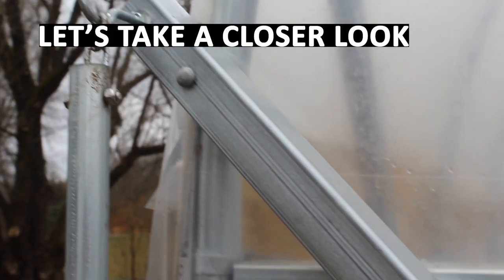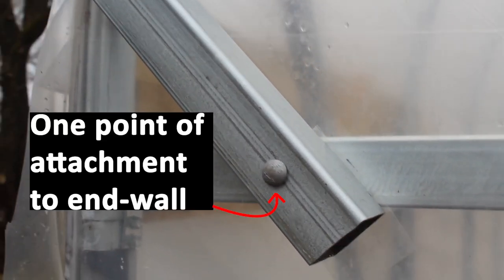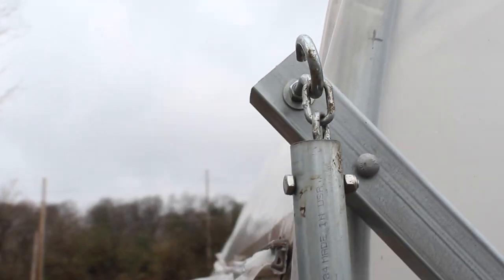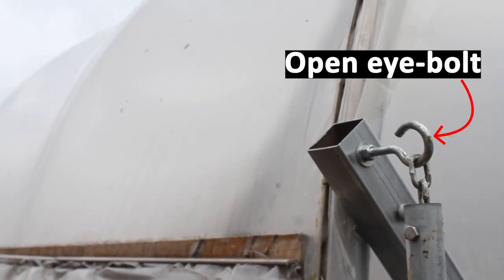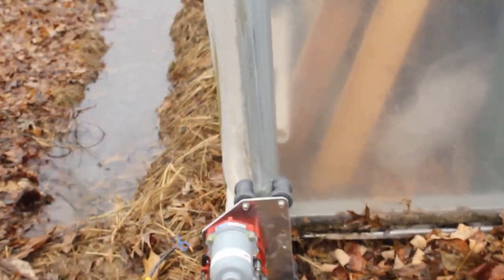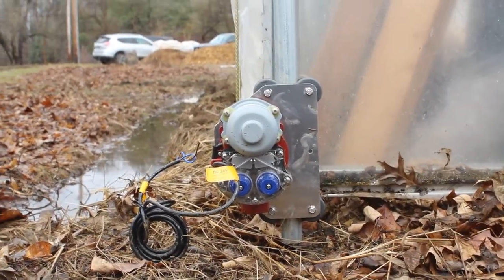Before I get into showing you how, let's just take a quick look at an extender pipe setup. We have the 5/16-inch diameter bolts going through an end wall member, with another one going through the end bow — you'll need two points of contact for permanent attachment. You have your open eye hook going through about 1 inch from the end on the extender pipe, and your guide pipe is hanging off of that, shooting straight down from the open eye hook to the gearbox operator, or in our case an auto roll-up side operator.